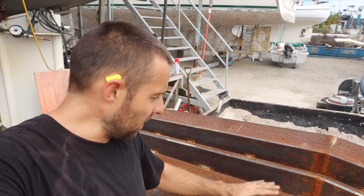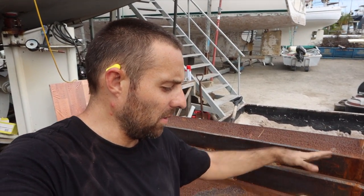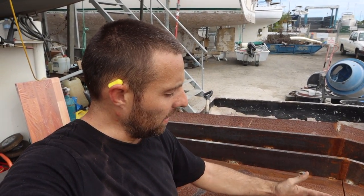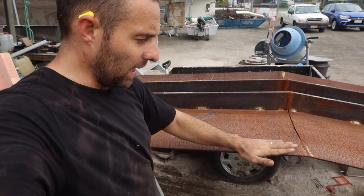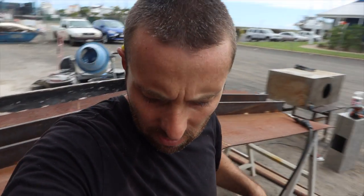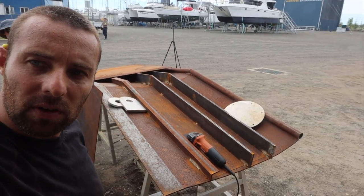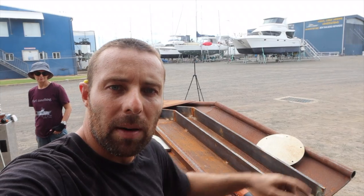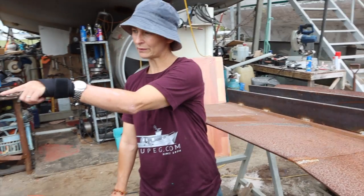Plan is to bring both wings up simultaneously in terms of build. So this wing here, it's only got the two strongbacks down the centre, we need to put the beam in over the side here, the 50mm right angle, and the flat bar on the trailing edge on this edge here. We also need to do the pipe on the far edge over there. So in a few minutes, it's hopefully going to look very similar to this one, with your trailing edge, the 50 mil, and then the round pipe. So a bit to get through today. The goal is to get this one up to this level.